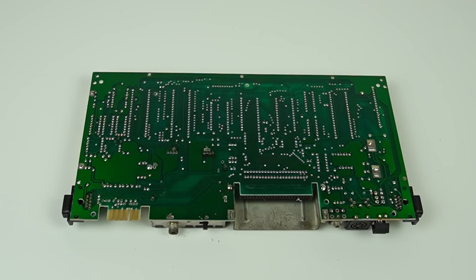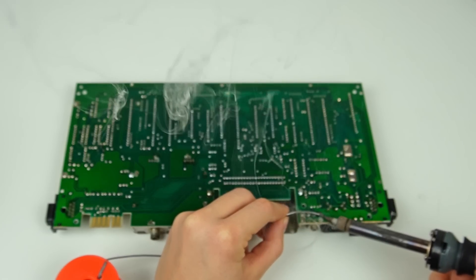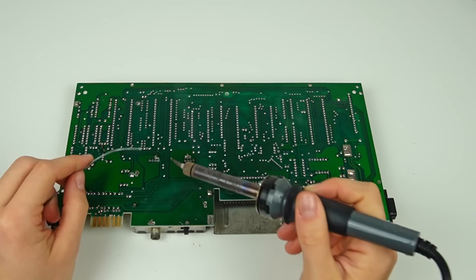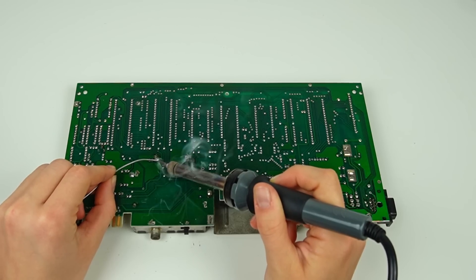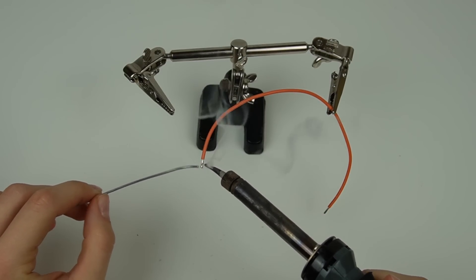At this point, I add solder to the two pins I need to connect, and create a path to transmit the video signal with a copper cable. Before I start, I would like to emphasize that this video, like others on my channel, is the result of my personal experience and is not intended to teach how to repair these devices. I'm glad to have the older version, since I really wouldn't want to remove the capacitor or cut a piece of the track, given the cost of the Commodore MAX and considering that it's not even mine. This way, it's also much more easily reversible.